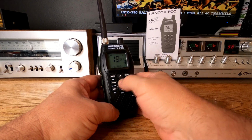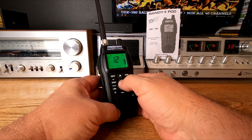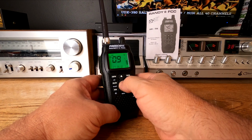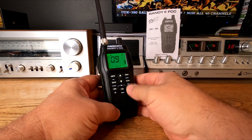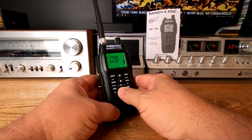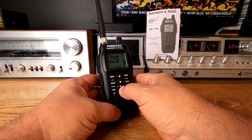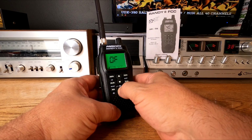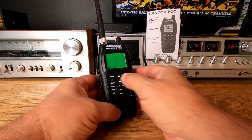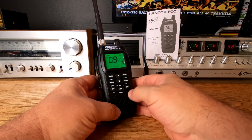And let's say we've got some people being unruly down on channel, I don't know, let's pick channel 9. Okay, we want to lock this out of the rotation, or maybe we're getting some birdies or some noise from some atmospheric conditions or whatever. So we're on channel 9. We're going to long press the menu button. It goes into scan skip. We're going to momentarily press it to toggle our on off. We're going to go to on and then confirm by a long press.